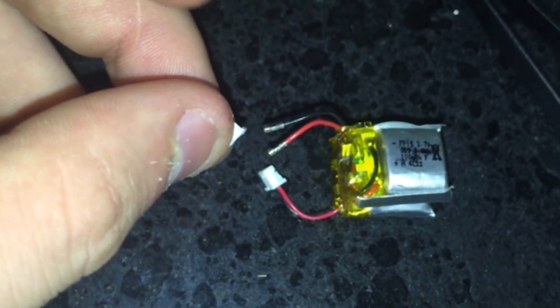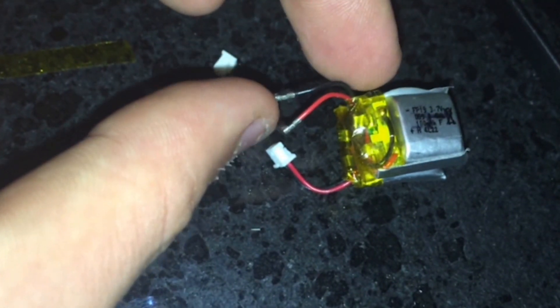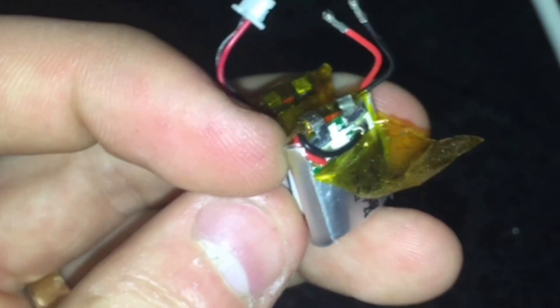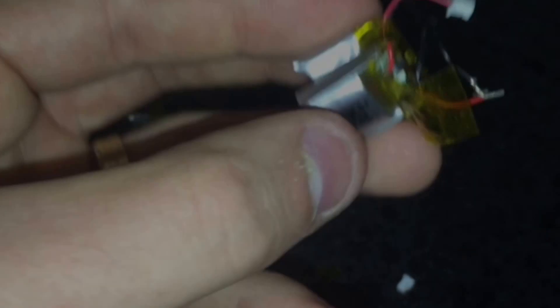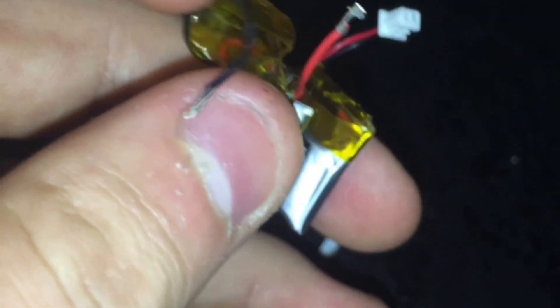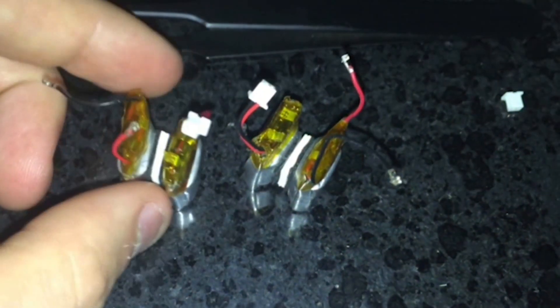At this point we're going to pull out the wires on each side and disconnect them — there shouldn't be much effort at all. Once you pull them out, make sure they are separated, otherwise they will short out the battery. The next step is pulling the black wire through those two metal loops and out the other side — be very careful and pull fast so it doesn't short. Then put the wire with the board back down, take the other piece of Kapton tape that we just removed, and wrap it back around. It should look something like this. Do the same with the other battery so both look like this.